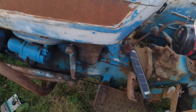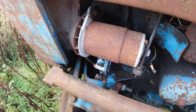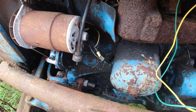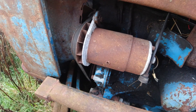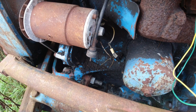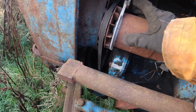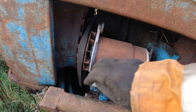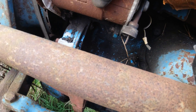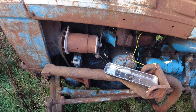I think the next task is to take this dynamo off, take it inside the garage and see what is going on. It looks like it should come off fairly easily, but it's quite old and quite tired. I wouldn't be surprised if it's quite corroded — the tractor was sitting around unused for well over 10 years, so that's not surprising at all. To take this off it looks fairly simple: there's a half-inch bolt at the top on the adjuster which I've already loosened off, and there looks like another half-inch bolt down the bottom and another nut and bolt. I'll pop them off and bring you back.